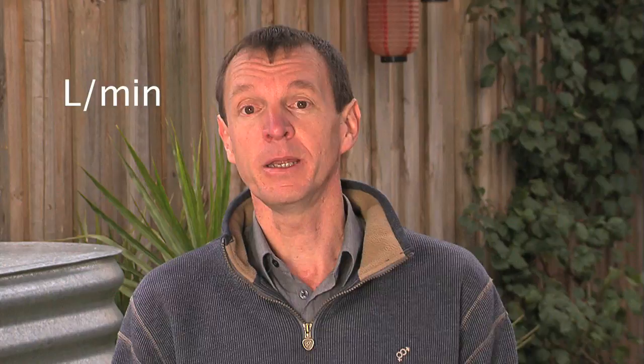But for most applications you'll need a pump. The type of pump depends on the number and type of fixtures it will be supplying. The main performance criterion for pumps is the flow rate in litres per minute at a specified pressure. This pump can deliver a maximum of 20 litres per minute at 250 kilopascals — enough for one or two outlets.